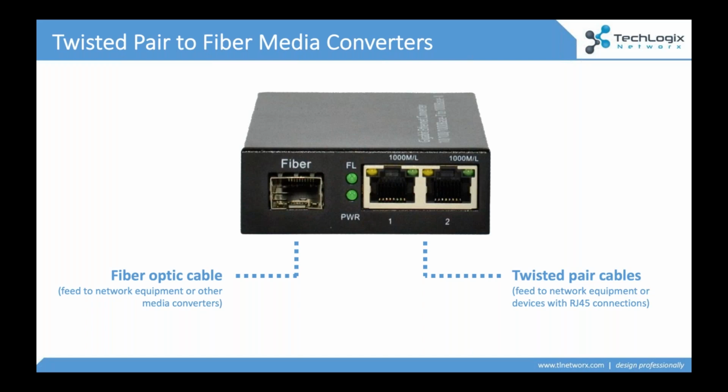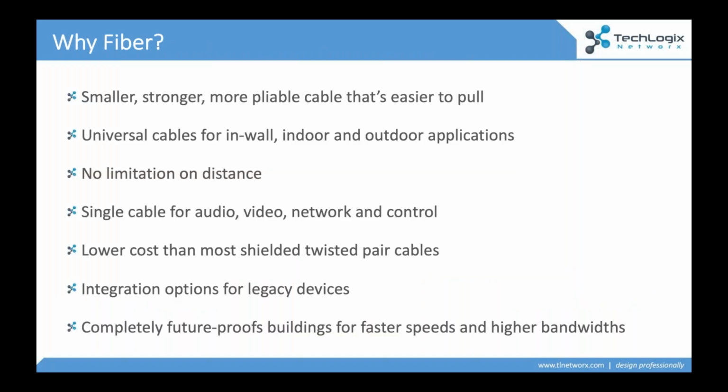And the advantage of this is you can pre-wire with fiber. You can run that cable to truly future-proof, but still use it today for the devices that are in the business, in the home. You can take advantage of some of the immunity properties of fiber, things like immunity to lightning, RF interference, electromagnetic interference, static electricity. Still use those immunity properties, but connect those legacy devices.